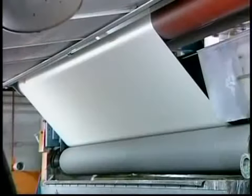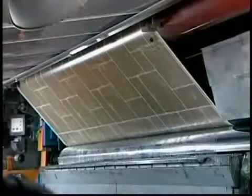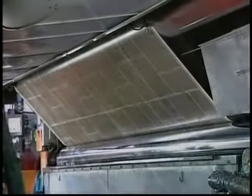complete. On the production line, printing works the same way. But because it's a continuous process, they use rotating cylinders rather than engraved plates. The flooring just rolls right through them, receiving up to 6 ink colors one at a time. A dryer dries the ink in between applications.